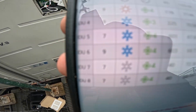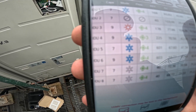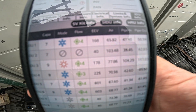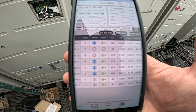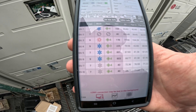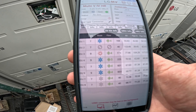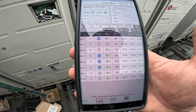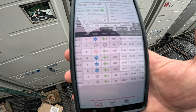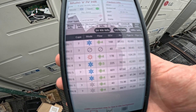IDU1 to 8 — I can monitor them all. If we look at IDU2 and check the air temperature sensor, it says it's at 103.48 degrees. With a reading like that, this machine will basically never turn off because the sensor is off. There's no way it's 103 degrees in there. So today's goal is to figure out which one of the eight air handlers has the faulty sensor.